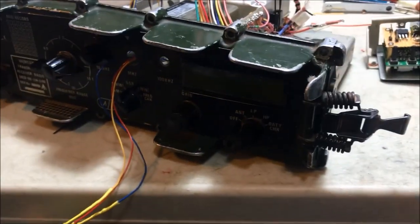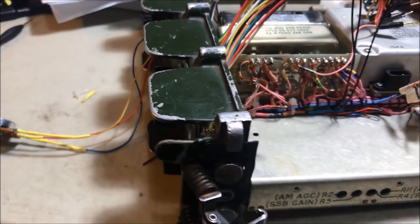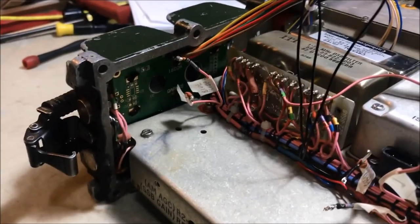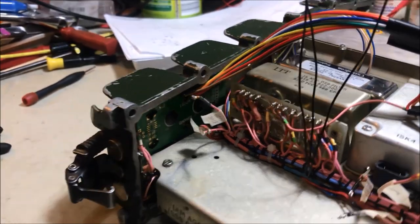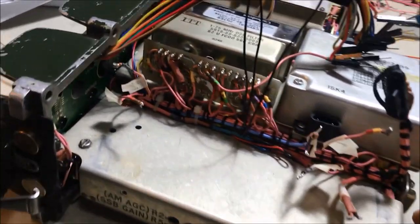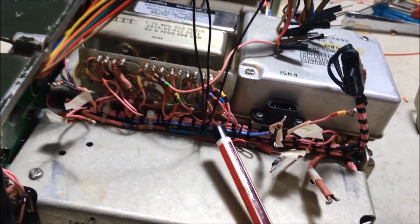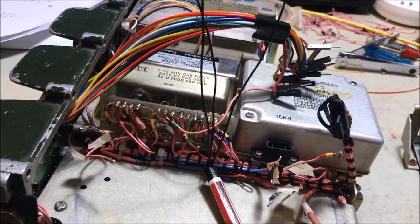Okay, so I've put the set back together again and started to do a little bit of the ancillary wiring and tidying up. So let's just talk about that. By the way, there's a good look at the display from the rear. Okay, so there we go. All right, so yeah, look, you're going to need quite a number of earths for different parts of the add-on circuitry. So what I've done, I soldered in half a dozen earths, all connected onto the main earth.